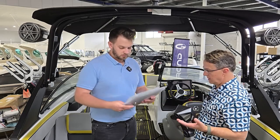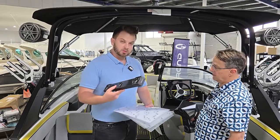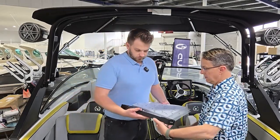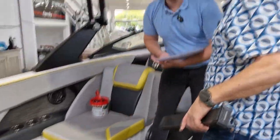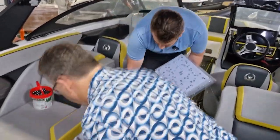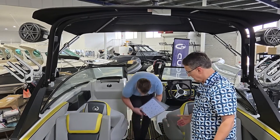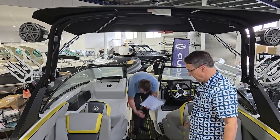The first thing we're going to do is use our scale bar, which comes with the Libra, in conjunction with our markers. We'll lay them out over the floor and create a global marker file first. We don't need them absolutely everywhere, but the more information we give the scanner, the better. These are placed in a kind of random placement to create a mathematical coordinate system for scanning.